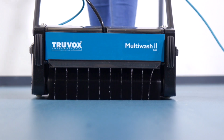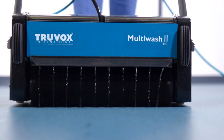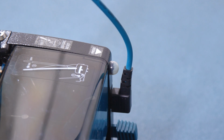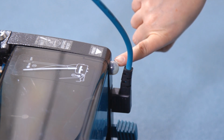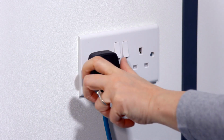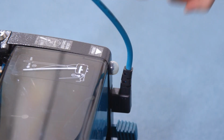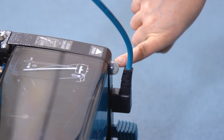In the event the motor is overloaded due to either improper power supply or an unexpected obstruction to the brush or drum rotation, the overload protector trips and protects the motor from any damage. If this happens, unplug the machine and identify the problem. Once corrected, plug the machine into a socket outlet and reset the motor overload button after a minimum of 30 seconds.